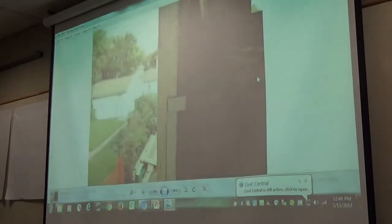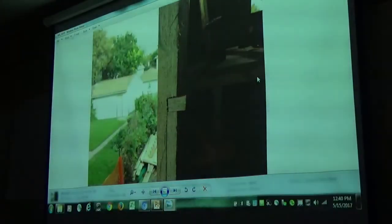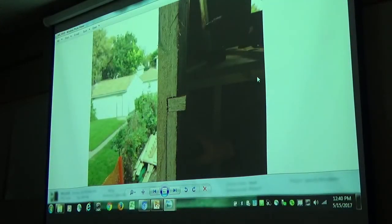Here's a cross section of the subfloor at the stairwell landing wall. Right. So when we ran those panels, we ran them wild, right? So that subfloor was totally embedded into the system, and then we went and cut out that rough opening. That just gives you an idea, kind of like what that's going to look like, right? Does everybody make sense where this is at? There's a window in the stairwell landing going from the first to the second floor, and this is the subfloor of the second floor.